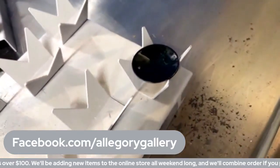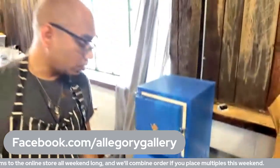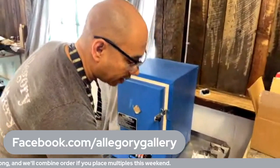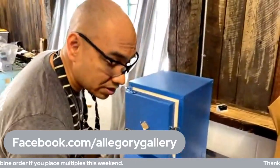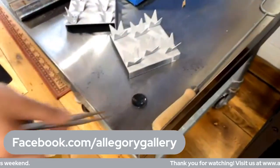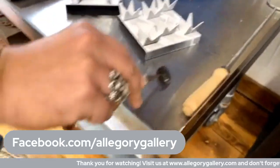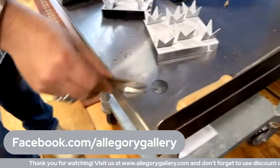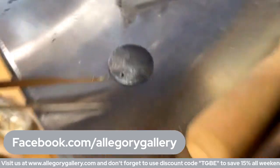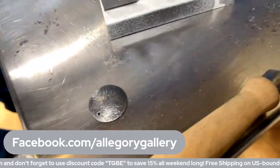So your piece will look like that. Now, after it's cooled down for a second, I can tell that it's cooled down. I'm using tweezers. I'm just going to put that on the table. This is a metal table, and that's going to help cool it. But notice the surface of that is black. That's called fire scale. And don't get too close because it's popping off right now. You can see the little flakes popping off.